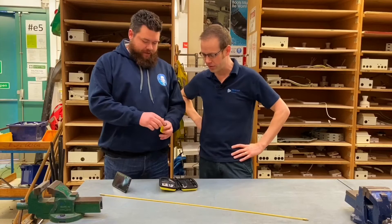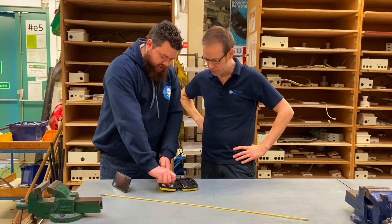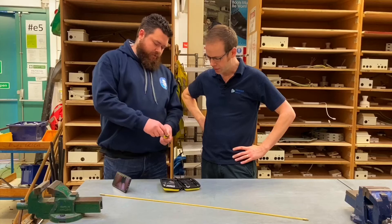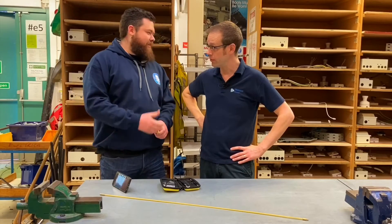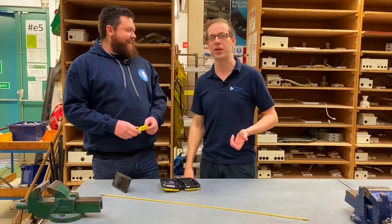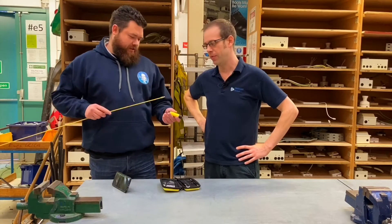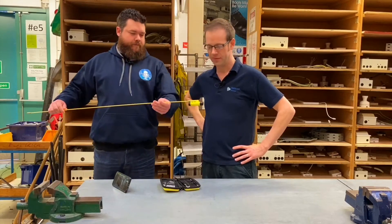Very simple — you take off the back, there's a little switch there, and that's also where you charge it with your Type-C USB. There's a little sliding switch, and it's got a little rubber cover over it as well to give it the IP rating. So it is IP rated — you can stick it down ducts underground which are often filled with water. It attaches to your rods, which is one simple reason it's called the Ferret Wi-Fi Superbot — that goes on the end and you're ready to go.